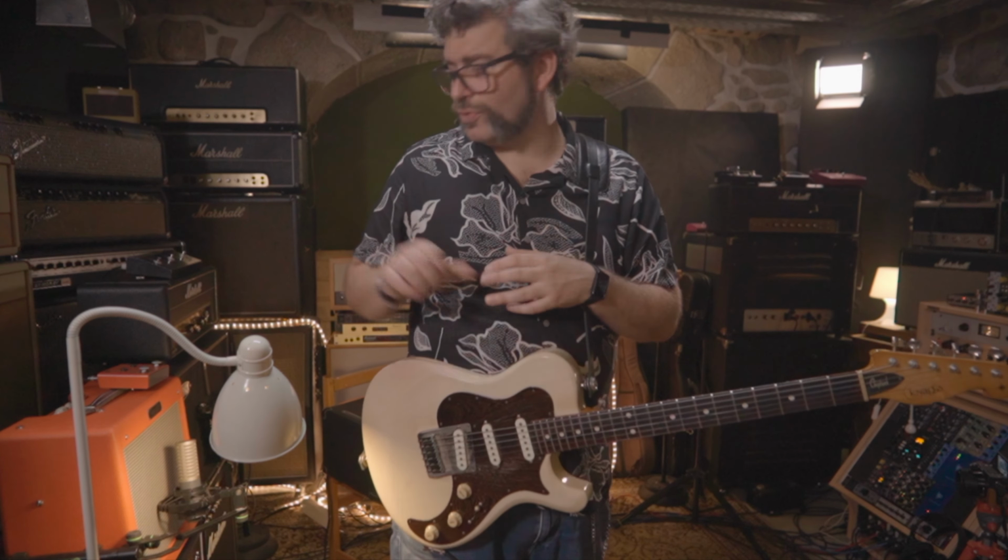Then on the British side, you have the EL84, which is Vox AC30, Vox AC15, so the EL84 is usually lower power amps, 15 to 30. If you have a duet of EL84s, you will have around 15 watts. If you have a quartet, you will have around 30 watts. That's, to me, very Voxy sounding, but Orange also uses it. The Blues Junior by Fender uses EL84. That's why I really like the Blues Junior. The Pro Junior, this one, also uses two EL84s. This Marshall 2061 uses EL84, so it has a really spongy character, a little more mid-range, a little more breakup to the tube.